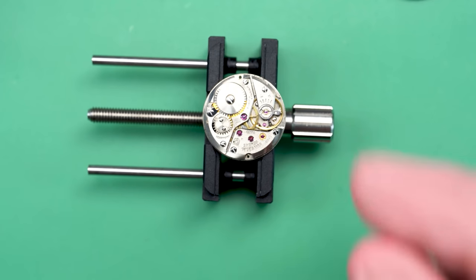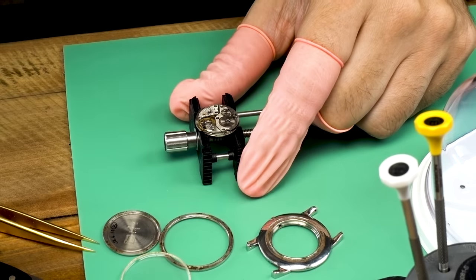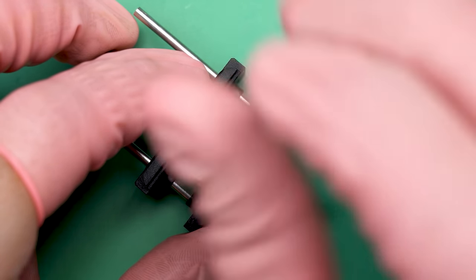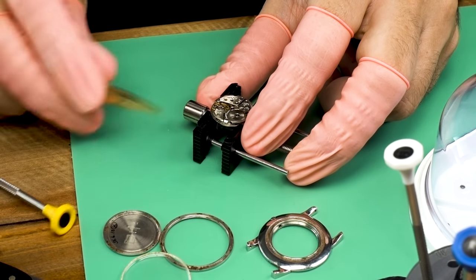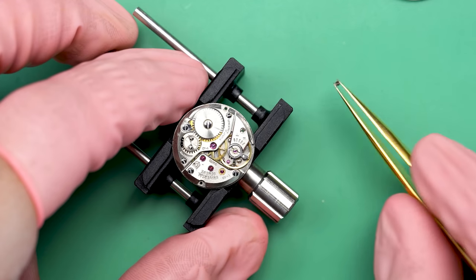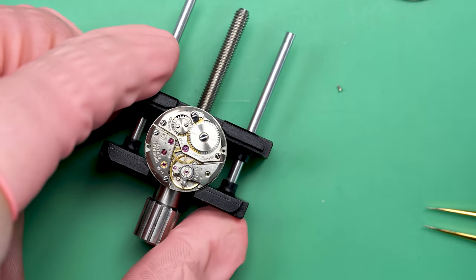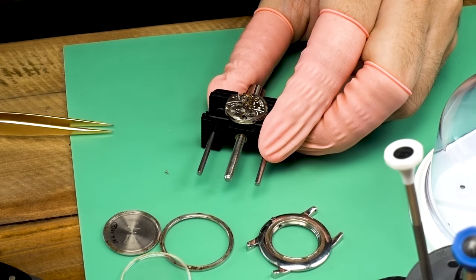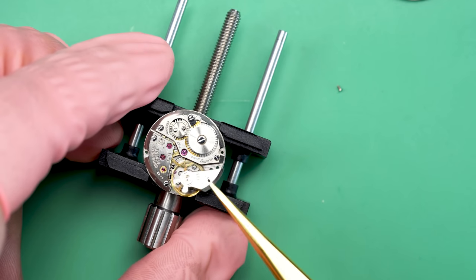That looks like it's in really good shape as well. This watch overall is in pretty good condition. I've got a little dial holder that we can put the dial in to keep it safe so it doesn't get banged up or scratched while I'm working on other parts of the watch. We can take the hour wheel off and move the movement onto a movement holder. Now, one of the things especially for those of you looking to get into this hobby — watches like this are very much the same as anything else from this era, but they are smaller. This movement is tiny, really small, and if you are just starting out, you should start on something bigger.